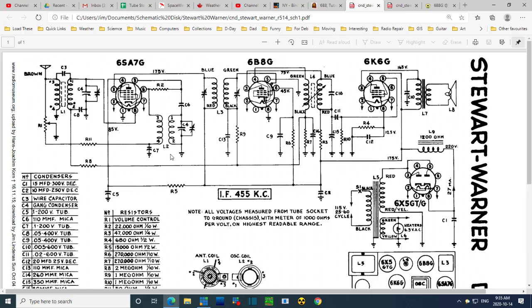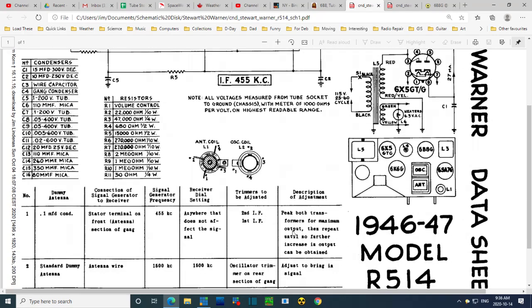Okay, I don't think I'm going to extract any more out of this. Oh, look at this. Yeah, I will. Wire capacitor. So this is that one I've been looking at over and over. C3, there it is there. So C3 is a loose coupling type capacitor, or a gimmick, right between the antenna and the grid. And why is that there? I don't know. They discovered after building this thing that it needed that capacitor, and found out in the laboratory experiments. I don't know.